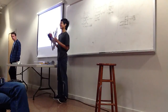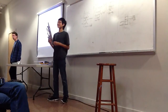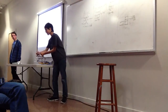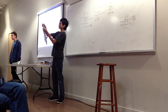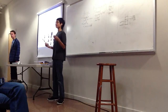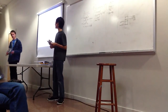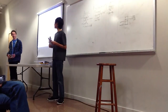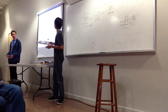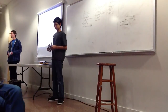Yes, right. How is that attached to the robot, and how is it driven? So the way you attach this to the robot, we had a tower at the back of our robot, and it was attached to the robot at these two points that I'm holding here. So one of them just rotates freely, and one of them is attached to a gear. I looked through a complicated gear train. I think it was 18 to 1. Yeah, it was huge. Big gear train because this is hard to lift. Gear train models help us compensate for efficiency.